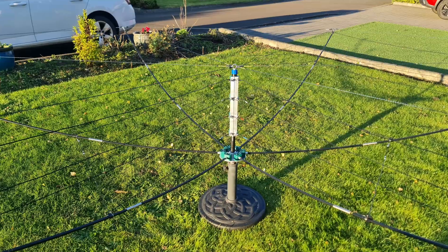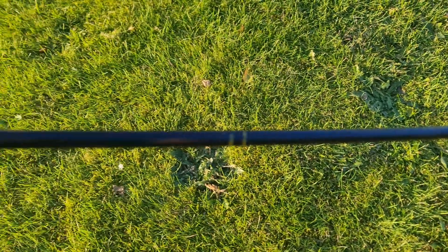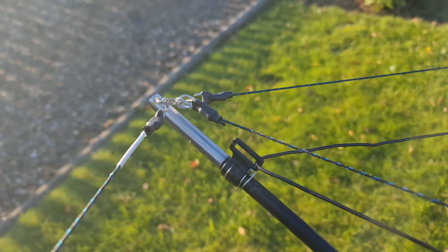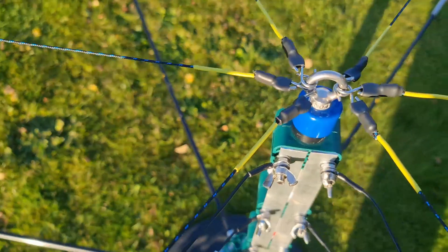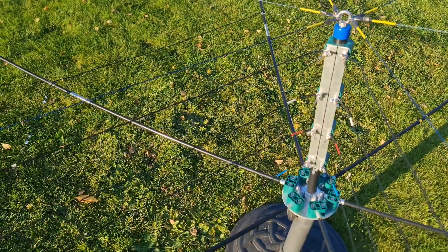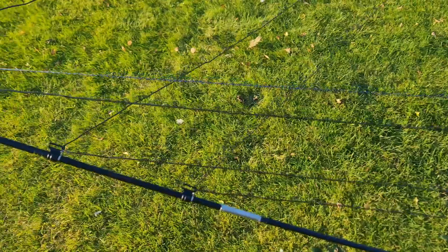The diameter of this antenna is just over 4m. So if you have a garden that's 4.5x4.5, or better 5x5m, you can actually put this antenna up. Now we're at the top of solar cycle 25, and band conditions are such that 15, 12, and 10m are going to give you a lot of fun. And because we've got aurora more often on 6, you're going to be able to use 6m much more often too.